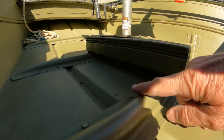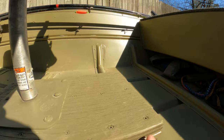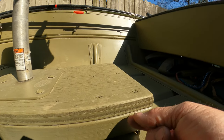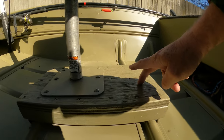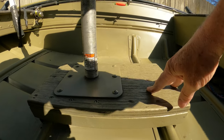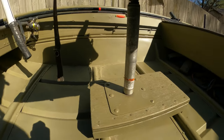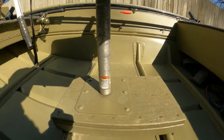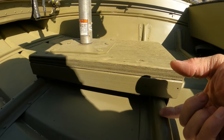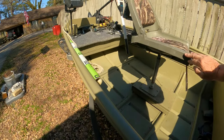I took some angle, pinned it through this sideways across here in the front and the back. Then I took carriage bolts and put them all the way up through these two-by-fours, just enough to put a nut on there, screw them down, and cut them off. Then I put the piece of plywood on there and locked it all together. The carriage bolts go all the way through the bottom — so it's solid. But if you have an aluminum welder, you can do a really great job just by building a solid raised platform across there. It gives me so much room I can do a full rotation around this thing.